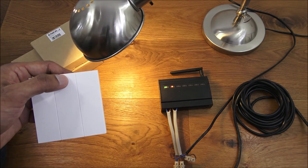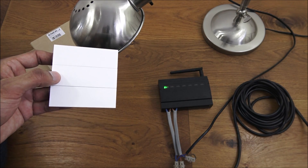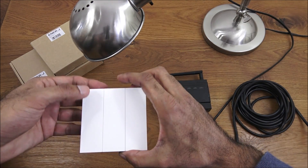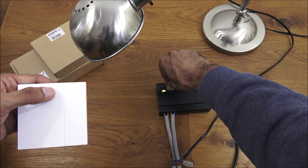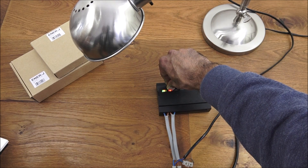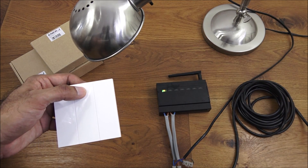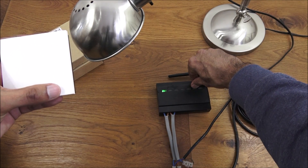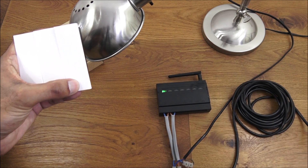You could have this a fair distance away from where all your circuits are. Next thing to show — if you've paired a kinetic switch, it's easy to clear as well. Just hold on to there for about 10 to 20 seconds. Eventually you can see it's flashing, then it will just stop flashing completely and it's cleared. It does nothing now. I'll program the other one, then hold on to that one as well to clear it. That's cleared now.